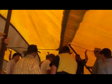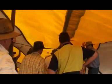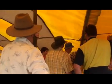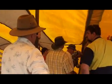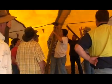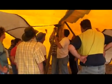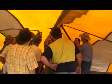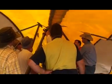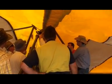After morning tea, it's back to the canopy where we move in underneath it and try to start lifting it up with the intermediate poles. Now, an intermediate pole is first taken to its pressure point, and there should be a rope there that is tied into the top of the pole, looped through and tied on the pole. This eventually stops the wind lifting the canopy off the pole and having the pole rubbed through the canvas or the surface of the tent.